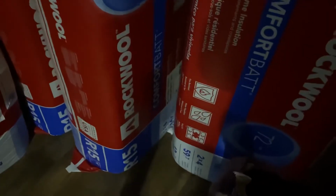And this rock wool, some pretty nice stuff. It's real easy to put in. If you guys have never done this, it comes in these 2x4 sections, and they fit just perfectly in the wall. This is a cutoff section that I was trimming with. It just takes seconds, and you can have a whole stud done. So if you guys ever get into hanging some insulation, this rock wool is great stuff. It has an R15 value, sorry. The regular pink fiberglass stuff, which I have, is an R13. This stuff's an R15. Good stuff.